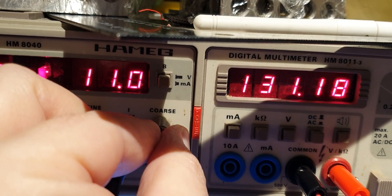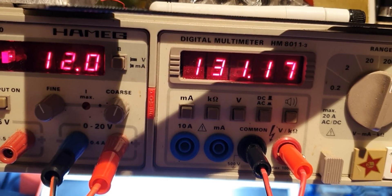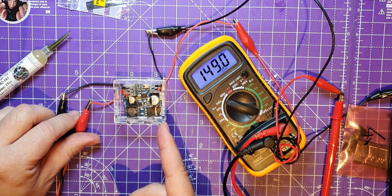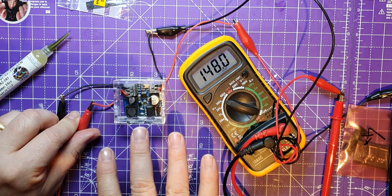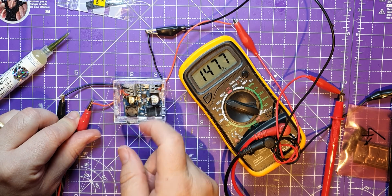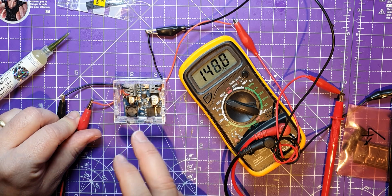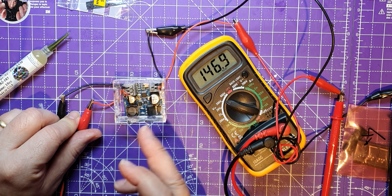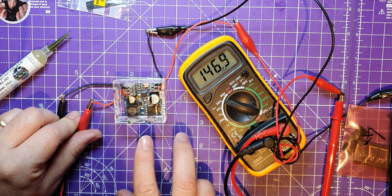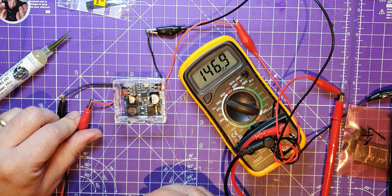Yeah! As soon as I hit nine volts I'm beginning to see 130 volts out. And now down to about 12 - and obviously the little potentiometer on it, if I change that I can up it to 180 volts. So there you go, I fixed it! It was the microcontroller chip. I fixed my Nixie tube converter that I blew up by touching the positive of the output to the variable resistor shell. The chips themselves were about four pounds for three, whereas these boards in the UK are about £15, so worth trying to repair if you've got a hot air station. If you enjoyed this please subscribe, bye!